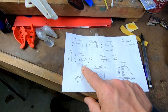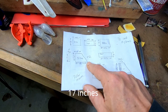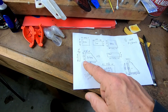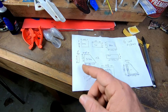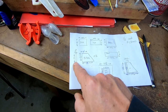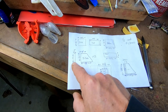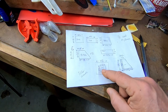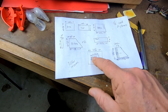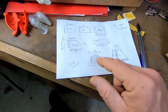There are two side pieces that are 9 inches along the top, 17 inches high, and 19 inches along the bottom edge. Turning the unit on the side, there are really four pieces that make up the side, counting the back. From the back, there's an inch and a half piece of plyboard — though two and a half would be even better. In between that and the side piece is plyboard with a 13 by 10 cutout, where the squirrel cage fan is located. Your filter fits over the top of that, which you spray through.